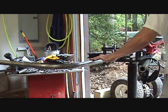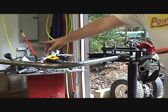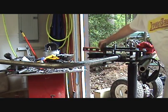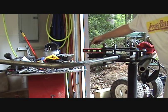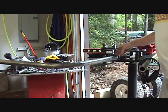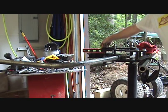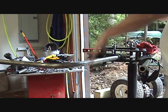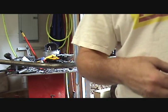I've got my hoop piece mounted in my bender. I made sure that this end of the pipe going down to the frame is level, or as level as the die that I'm using to bend it, so that this leg will be parallel to this leg once I bend it. You don't want to have this leg down or up because then the legs would be out of shape a little bit.